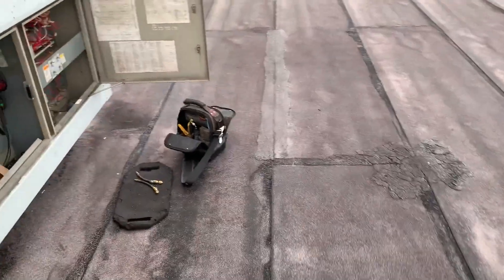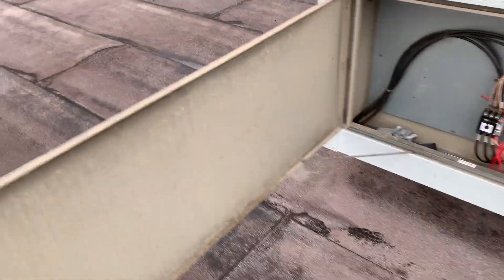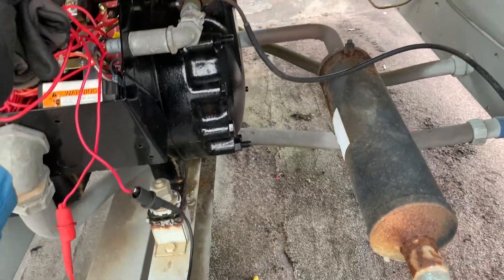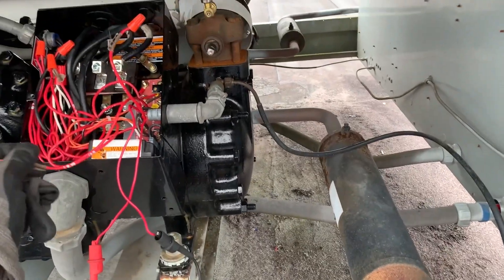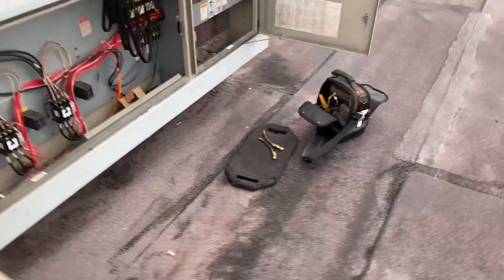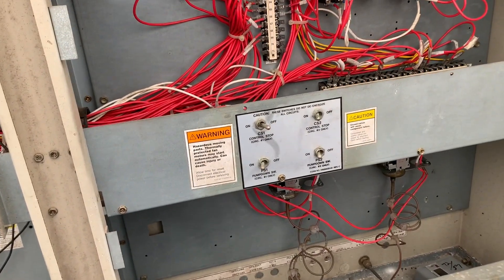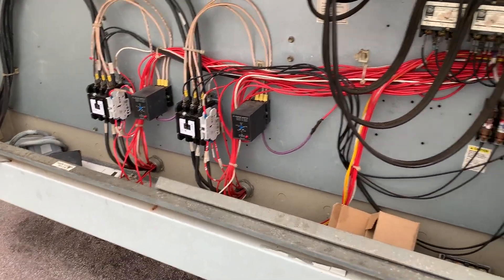You can see here a low pressure switch tied back into these two wires — open line. If I hit the control switch even with them out of the circuit... just to be clear, these wires were properly wired in series. Now, are these the right wires? They're totally disconnected — they should create an incomplete circuit, manually eliminating the low pressure switch and stopping the compressor from running. But as you can see, it starts and runs.